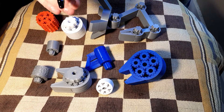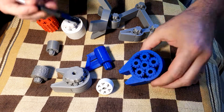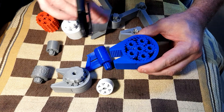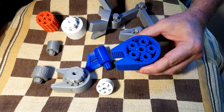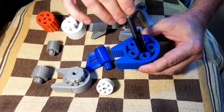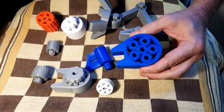I'll place some links in the description, but there is one constraint in particular that conventional planetary gear systems must satisfy that relates to the number of teeth in the sun, planet and ring gears: r equals s plus 2p, which is required for matching tooth pitch, or the number of teeth per unit circumference. We'll be keeping the other soft constraint where r plus s is evenly divided by the number of planets, which ensures evenly spaced planets and will make life much easier.